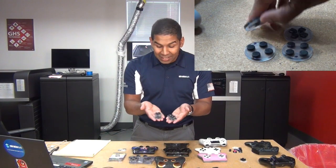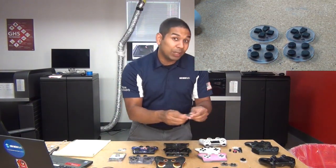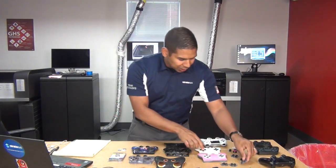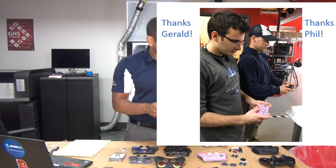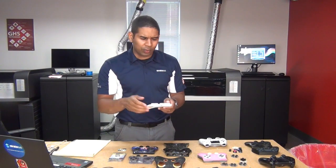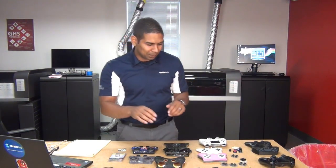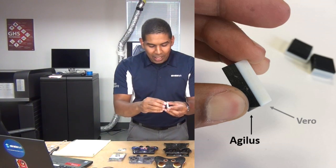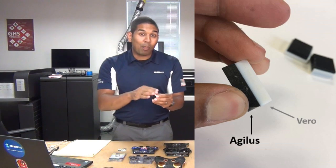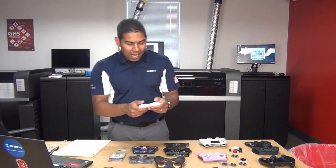So that's what I did with these tiny test models, which took almost no time — about one hour laid out flat. I tested 16 different button combinations to see which one most simulated what we were going for. I chose the right combination and tested it with a couple of my co-workers. It didn't feel exactly like what we were going for, but it felt close enough for them to say, yeah, I can see what you're going for. And at this level, that's all we want — we're trying to get a prototype into our decision maker's hands fast, so close enough is fine. If you just have the Agilus and Vero face-to-face in your CAD package, they'll bond together during printing, tighter than even if they were superglued. Now we've reached level two of realism: the model is the right size and shape, and it feels pretty much like the prototype we're going for.